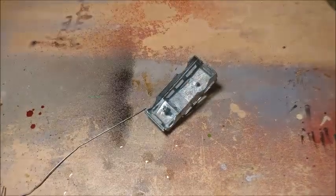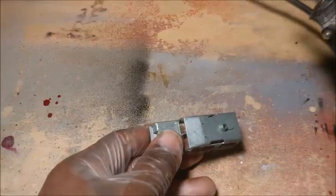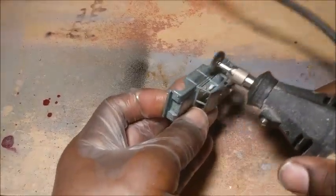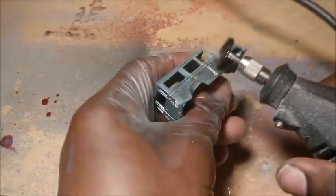That was done, I dried it properly, just to have a better look at the casting. The casting, as I said before, was in good condition. So now I'm just using my rotary tool and a wire wheel to give it a little polishing.